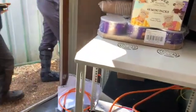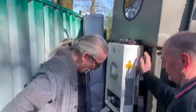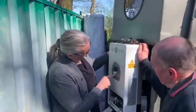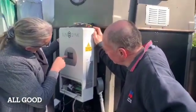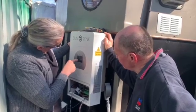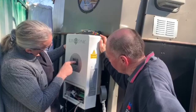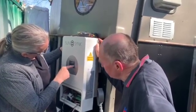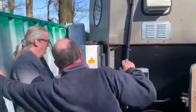So we can test the inverter side now and see what we're getting there. We'll turn the box on in a second - let's just check what's connected. It's important - it's showing the battery communication is working when it's set on the pin rather than on the battery. That's very important, because if you haven't got communication on the battery then anything else you're doing is a waste of time. We've been right for the first time - the batteries are now talking to each other.